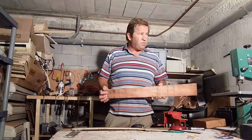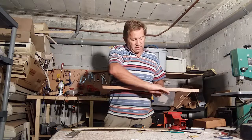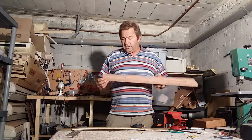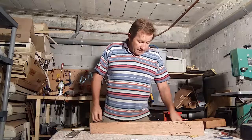But you waste a lot of wood. You're using a 2-inch piece, 50mm piece, and then you cut it like this to your angle here. This piece is waste at the back. The way I'm doing it, you can get 2 necks out of the same piece of wood, and it's stronger as well.